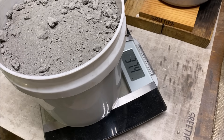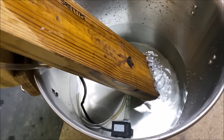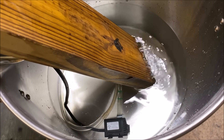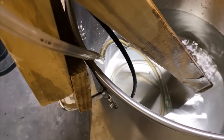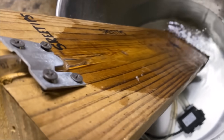It looks like we've got 37.4 pounds of cement silver here — take off half a pound for the bucket, so there's 37 pounds of cement silver in this bucket. This is my water board. I've got a submersible pump in a stainless steel tank with about seven and a half gallons of water, and the pump pushes water up through this little line right here and sprays it down the board to keep the board cool.